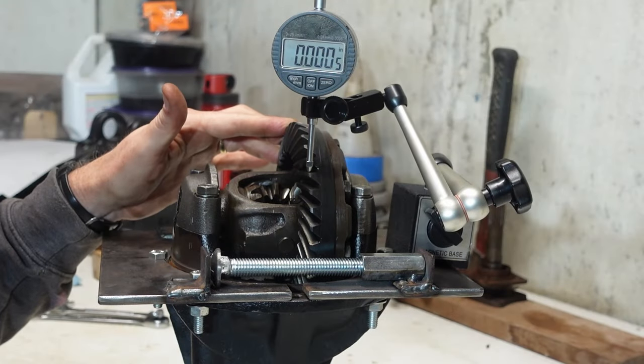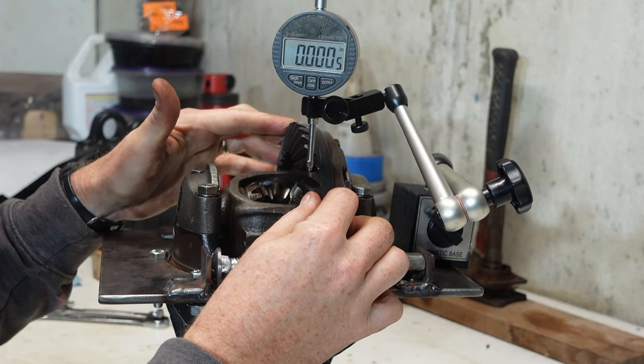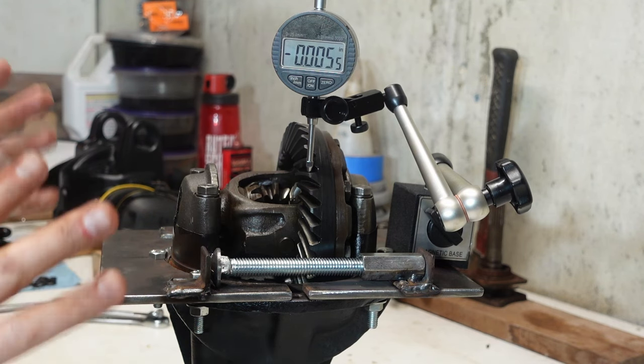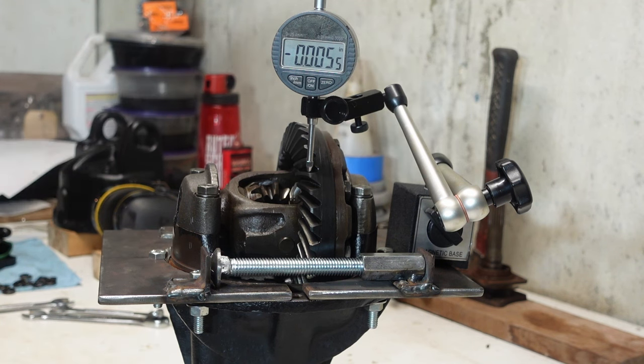I played around with the shims a little bit and it looks like I got it — it's just about five thousandths or so. I'm going to continue to rotate this and check it a couple more times at the cardinal directions and probably a couple more spots to check it. Like I said, you want to take it at several different spots. It's just mixing and matching the shims to get about what you want for backlash — nothing more than painful reiterations.